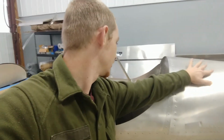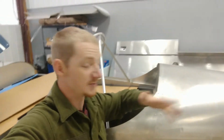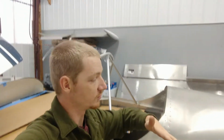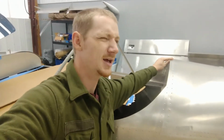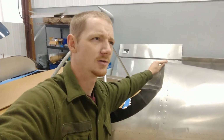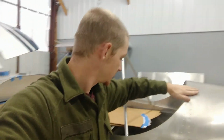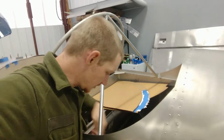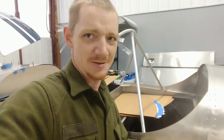And I think what I'm going to do while I got this off is I'm actually going to take some yellow primer. It's made specifically for aircraft. It's direct to aluminum because from Zenith they want you to use a product called Cortex? You can't usually pronounce it right. But that's been put in all the seams. And I believe it looks like, yeah, the bottom pans where water might set have been coated in it, but it doesn't look very nice.